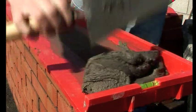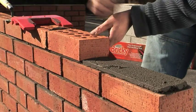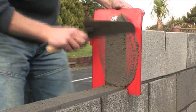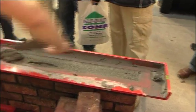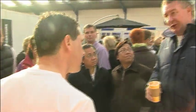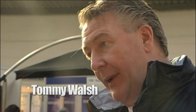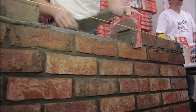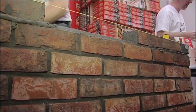The process just couldn't be made any more efficient. The templates ensure you place exactly the right amount of mortar just where it's needed, eliminating all the waste and mess which was traditionally associated with building walls. Into the cutaway section, press the thumb into it, scrape it across — just like so. That's the hardest part for anyone to do: to get a consistent bed. All the best inventions are always simple. The hardest thing for people to do is to get an even bed, to get the joints correct, and to get it in a straight line.